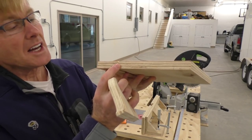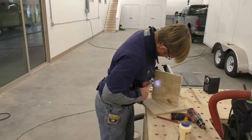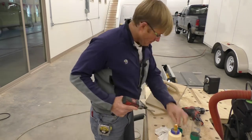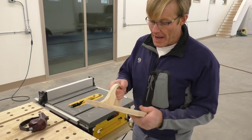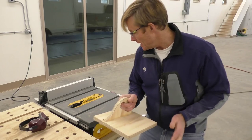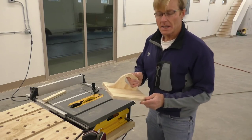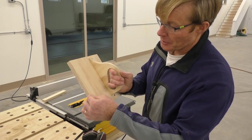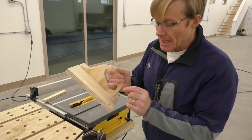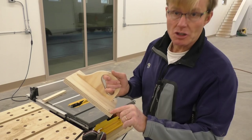I've made a really shallow dado — dropped the bit down to about a sixteenth of an inch — just a mounting place to put the handle, then glue and screw it through. With the handle mounted and the track mounted, the next thing is to run it through the table saw to cut it exactly where needed. For the angled cut to make the shim tapers, I need to cut an angled line starting at about one inch from the leading edge and ending around seven-eighths. The bottom side will cut further than the top, so I'll get most of the cut made and finish the last bit with a jigsaw.